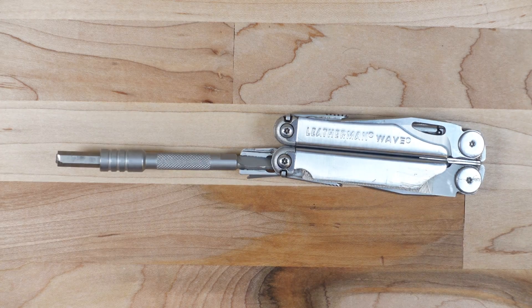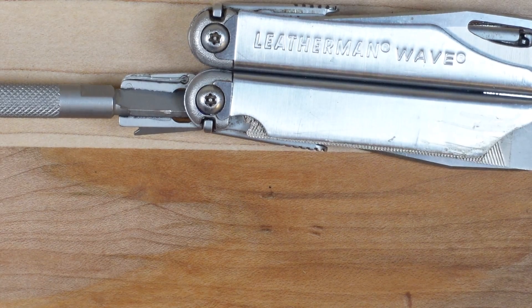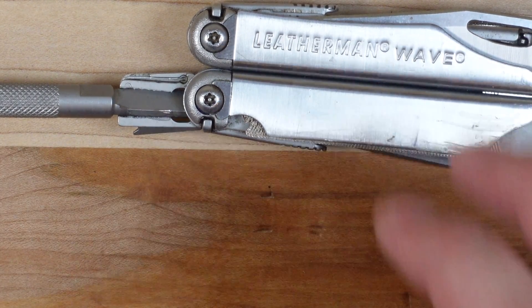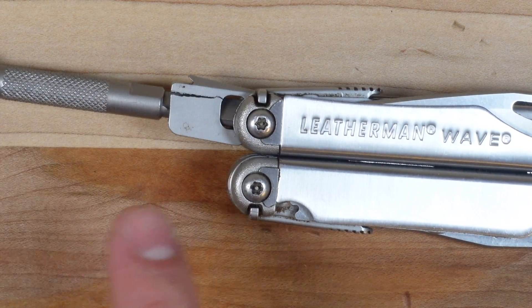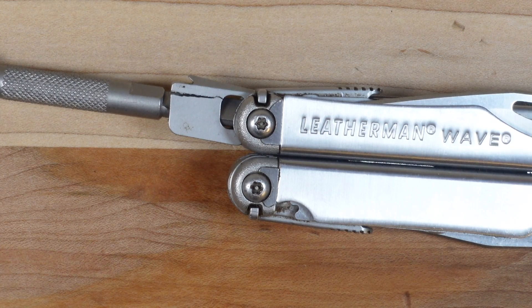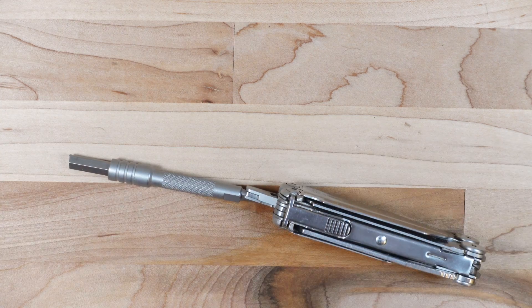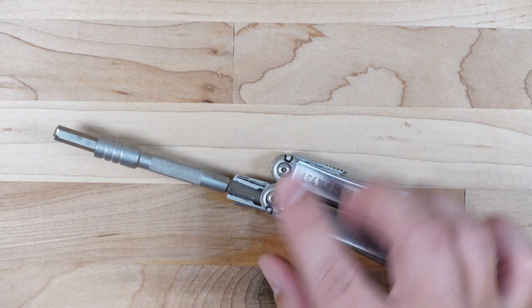Something just broke. Taking a closer look inside: the side of the bit adapter completely broke out — it didn't bend, it just completely sheared out as the bit inside tried to rotate through the wall. Flipping it over, this side was also about to fail — there's a big crack. On the other side you can see the impression of the edge of the bit, so it was clearly trying to break through there as well. The bit adapter held the load pretty uniformly. I was actually surprised it didn't break at the end where the spring is — I thought that U-shape might just open up — but no, it just broke the sidewall right out.